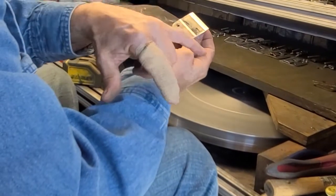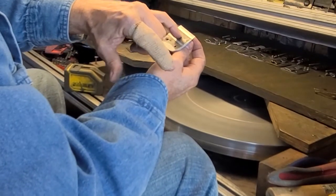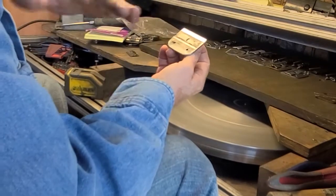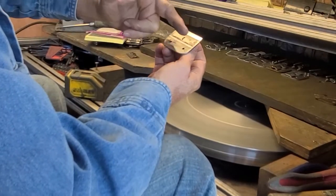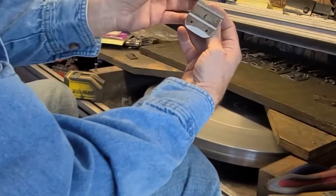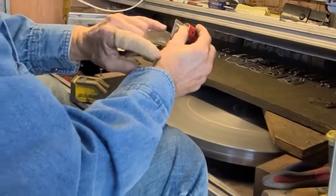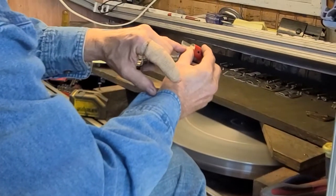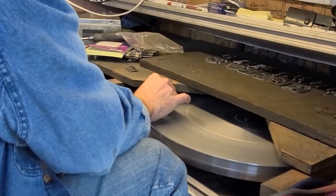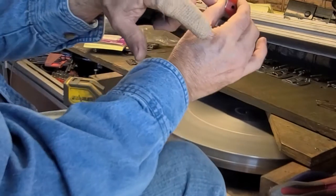When I'm doing my grind, I've got my laser and it's bisecting through the center line here. So I know I've got a certain hollow on that side and a certain hollow on that side. So you're lining up between the two rails. It's about right there, and if you look at the edge of my thumb, I'll lay it out right there so it kind of lights up my thumbnail. Okay.